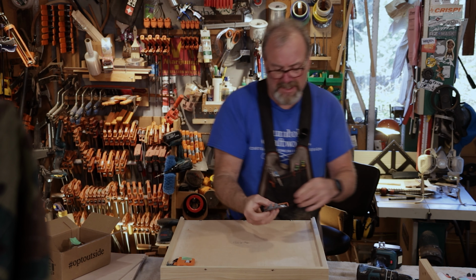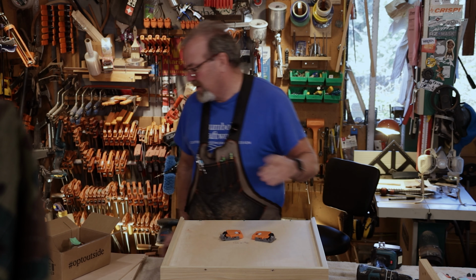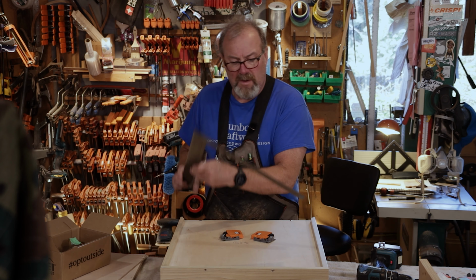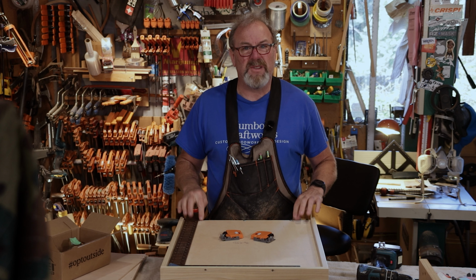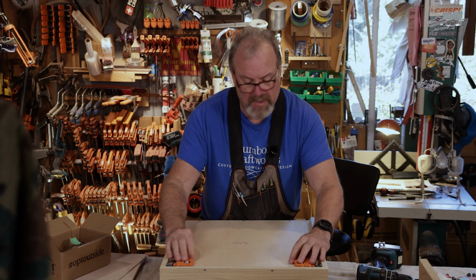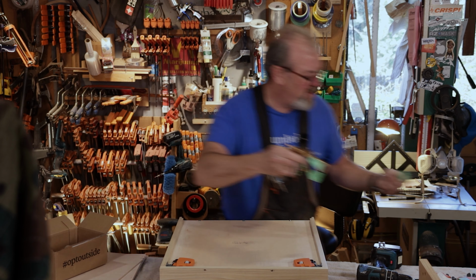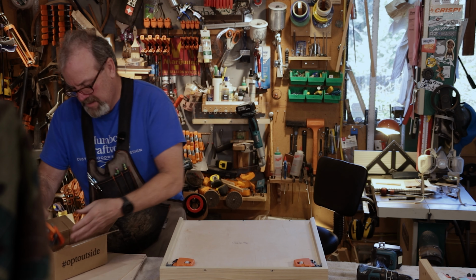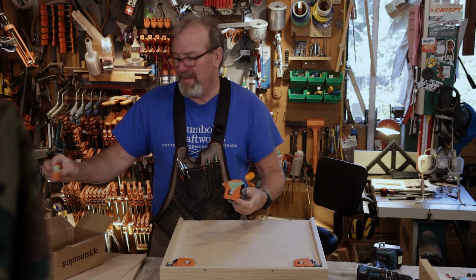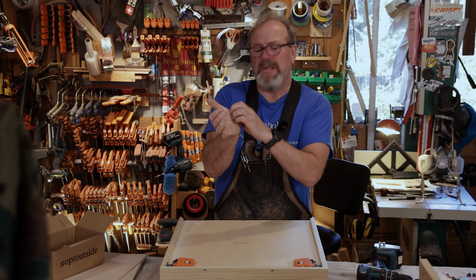Okay. There's a couple things we do when we are post-assembling drawers. We check it for square to make sure it's square because it was square when I built it. And then after that, once we get this done, yeah, it's totally square. So I checked this to make sure it was square before I put these screws in the first time I built it. And that's pretty damn good. So when we're post-assembling, we check for square. Once we do that, then we're going to put our locks in place, which we have tons of screws for in here. So we have all of our handles that are labeled. We're going to use all of those. Every single one of our locking things all has a label on it. It sounds like a waste of time until you go to put all this stuff back together, and then it's not.